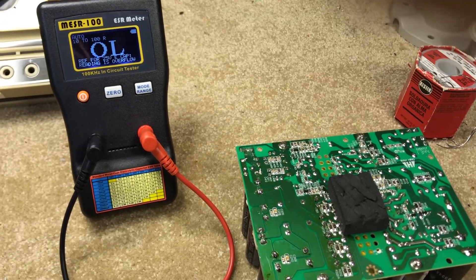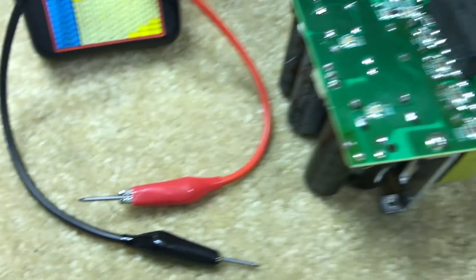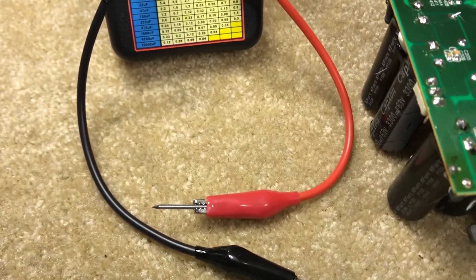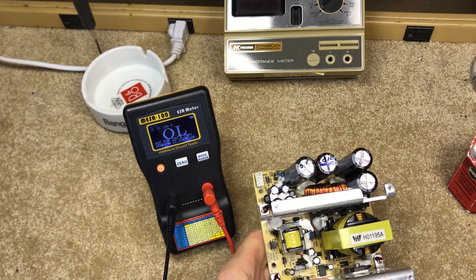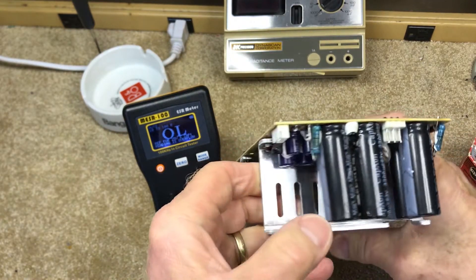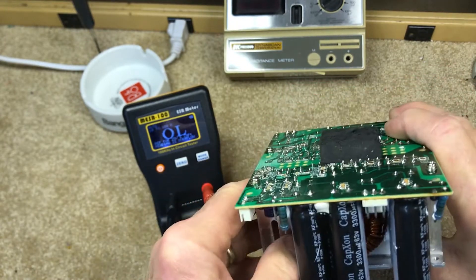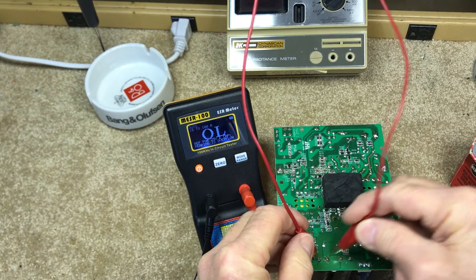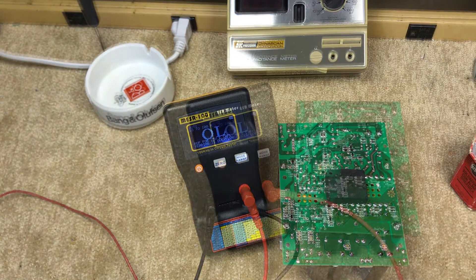The best thing about an ESR meter is that you can do the same test with caps in-circuit, which saves a ton of time. To do that I've inserted finish nails into the alligator clips — be careful not to use too long a lead with an ESR meter because that will change the reading. Use the shorter leads that come with it, do the trick with the finish nails, and you can go straight to the circuit board. Each electrolytic cap has polarity, so pay attention to the markings — connect negative to the black lead and positive to the red. Also make sure all electrolytics are discharged first so you don't shock your meter.